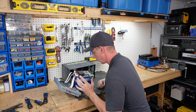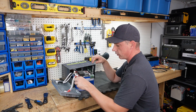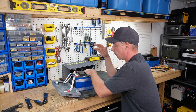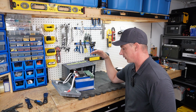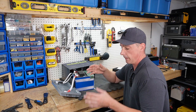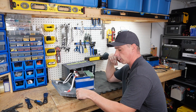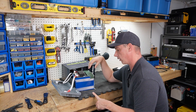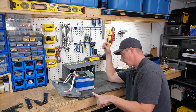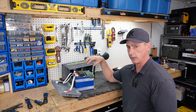We have our vents, everything looks pretty clean. The conductors are number eight gauge — two number eight conductors on the positive and two on the negative. There's no temperature sensor to test. All in all it looks like a pretty good battery. The bus bars — I would like to see something with a little hump in them for expansion and contraction, so they don't put pressure on the posts, as I've mentioned in previous videos. If low-temperature protection is an issue for you, you may want to find a battery that has it. But if it's not an issue, or you plan to set it up in your system yourself, you can use this battery. Let's put it back together — I want to put a heavy charge on it and see what happens with the temperature.